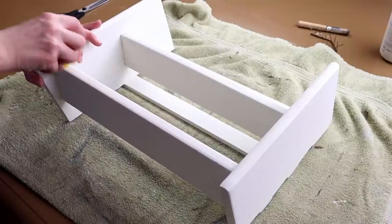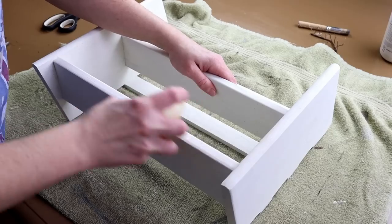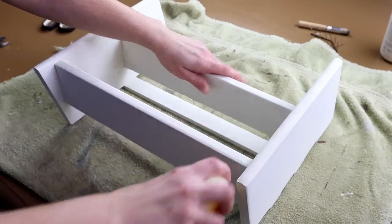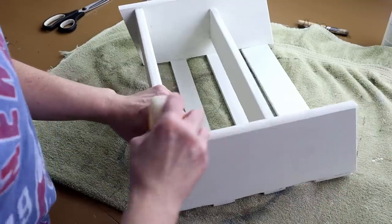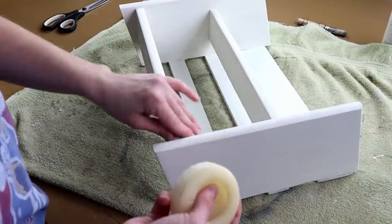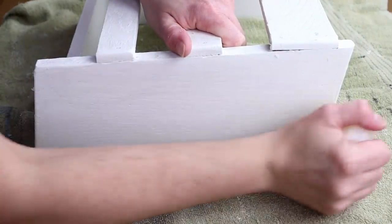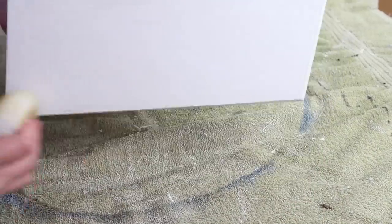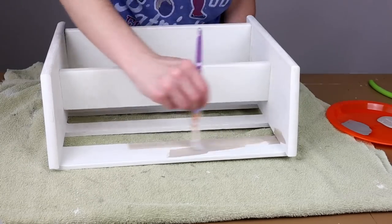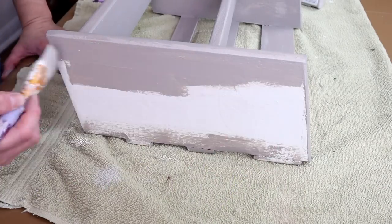After my paint was all dry I then took an old candle and rubbed the wax over top of the paint on my entire piece. I'm trying out a new chippy paint technique for the first time — just rubbing this old candle on top of my entire piece right over that plaster color paint. I wish I would have had a thinner candle or even a wax crayon to get in between the two shelves. Once I had the wax all on I went in with my castle colored chalk paint and painted that right over top of the wax — two coats over top of the wax.